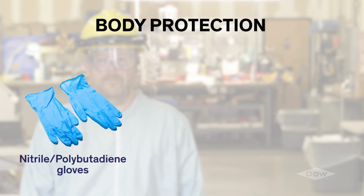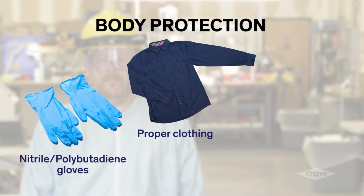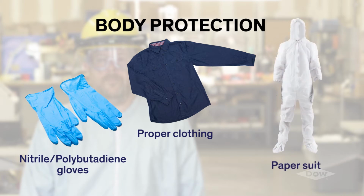Wear gloves when handling the unreacted chemicals or when applying the mixed materials. Nitrile or polybutadiene gloves are recommended as they provide resistance to the isocyanate and are also tear-resistant. Wear proper protective clothing over the arms and any exposed skin that may come into contact with the materials. Paper suits are acceptable protection as long as they are discarded after being stained with unreacted chemical.